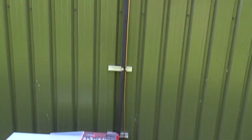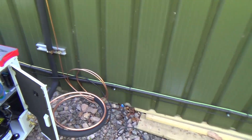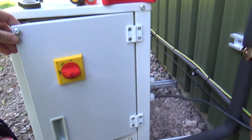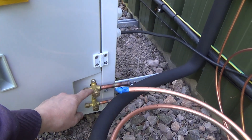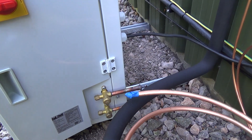The pipework is up the wall and then through above the ceiling and onto the cold room, which we might have a look at in a minute. It's not a bad little unit. I prefer some proper service valves rather than these air conditioning style ones, but that's what everyone's fitting nowadays because they're cheaper.